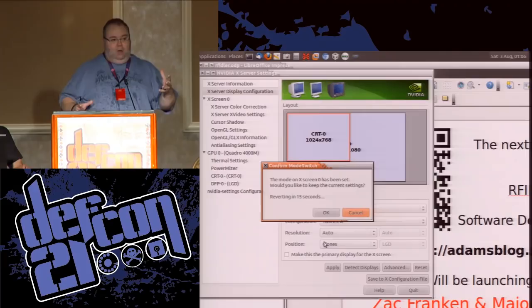So the question was, sometimes they're almost spherical. Does that impact the time to etch? And the answer is yes. Simply the greater the depth of epoxy, the more time it takes. Well, you'll almost never be able to do this and get it right first time round. So expect to go through a few chips until you actually work out, okay, it's going to take X amount of time. And well done.